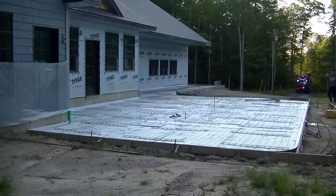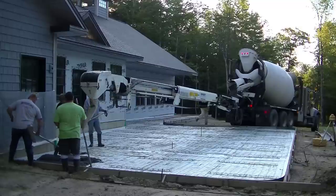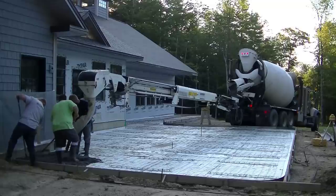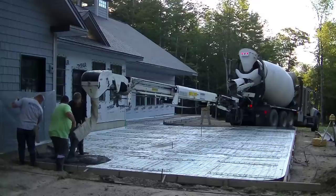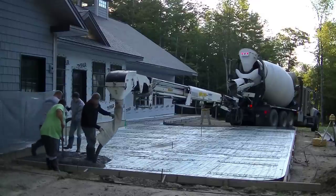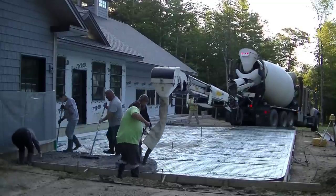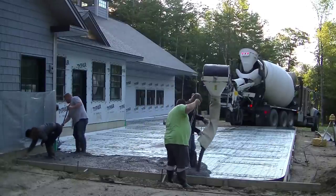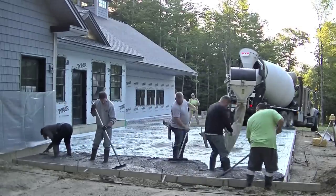Today I'm going to show you how we pour a 1600 square foot concrete patio. We got this all formed up a few days ago — we've got some curved corners, two inches of styrofoam under it. We're in Maine so we go through a lot of freeze and thaw cycles; the styrofoam helps keep the frost from getting under the patio and heaving it. We've got wire mesh, slab bolsters under the wire, and we're using 4000 PSI concrete with three-quarter inch stone and microfiber mesh.